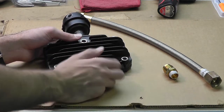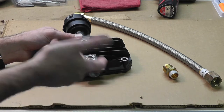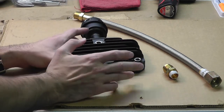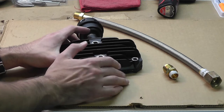If it leaks, the compressor runs more often to compensate for that leaking, and it could wear your pump out — valves, rings, you name it. So certainly want to make sure you have no leaks. And if you have a problem with the transfer tube or the copper kinking or cracking because of vibration, this is an excellent solution.